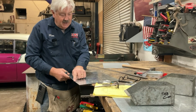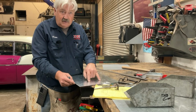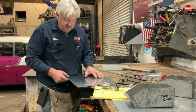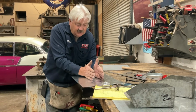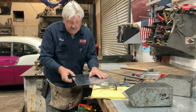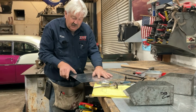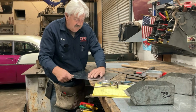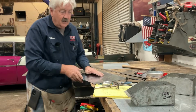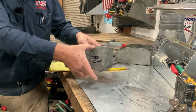I wouldn't take that dimension. I wouldn't go 4 1/2 and then add the other 4 1/8. I don't want to take all these measurements from one side. Because if there's any discrepancy in my stock, maybe I didn't cut it right, at least I know if I came around the perimeter and I marked 4 1/2, and then I marked 4 1/2, and I did that again a third time, at least whenever I fold it up, I know all my corners are going to come out even because they're all measured.